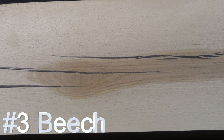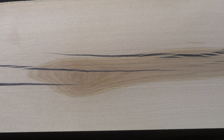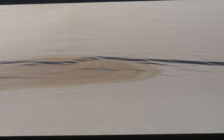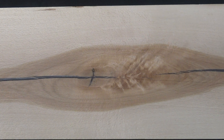Beechwood. American beech, along with its Euro cousin, are cream color to light tan. They can have some darker patches in there. They can also have a muted undertone of orange, pinks, and yellows. Beech withstands impact very well, which is why in a lot of high-end chisels they'll have beech handles. It makes for good mallets as well. It's a great choice for steam bending, and if you enjoy herring, beech is typically what they use to smoke it with. It's a strong, straight grain wood with many purposes, and if none of that's your cup of tea, it makes excellent firewood.